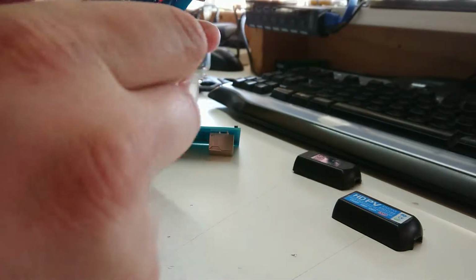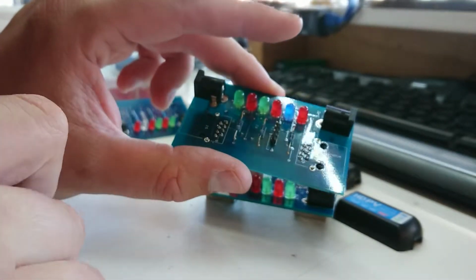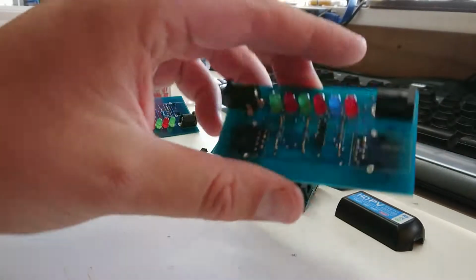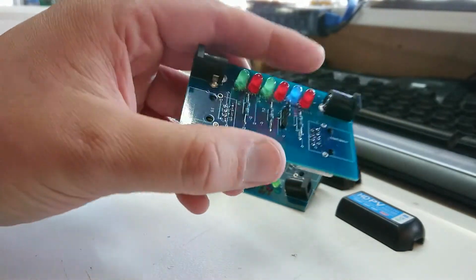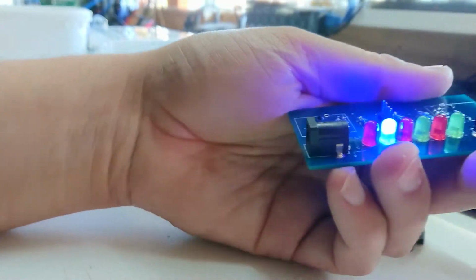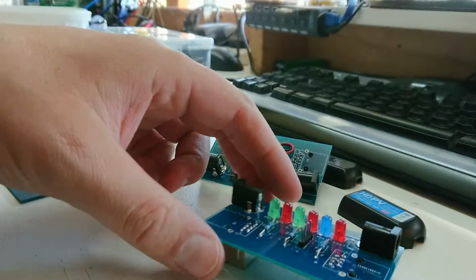The other 2 pins on there are the video outputs, so we could easily plonk a little DuPont connector on there with a BNC or something else to test the signal as it's going through. These are also modified so that we can hook in line with a cable and have an output on the other side and tap some power off, or use them as a power joiner. And we can also use them to test if the power is working as well on a power supply. So just a general diagnostic tool.